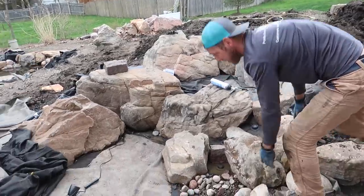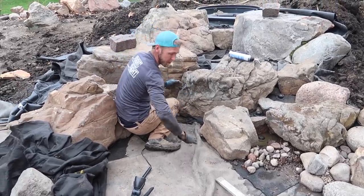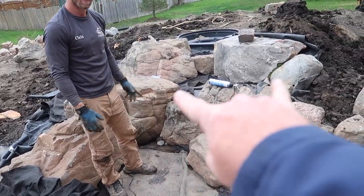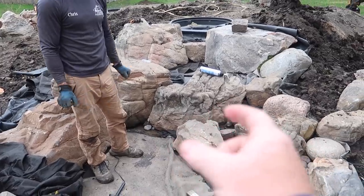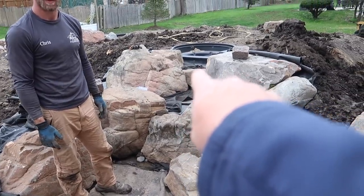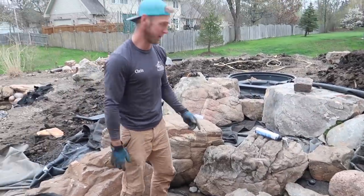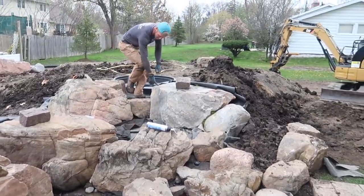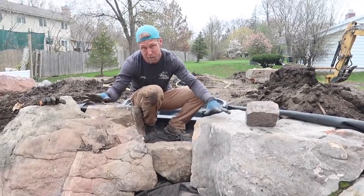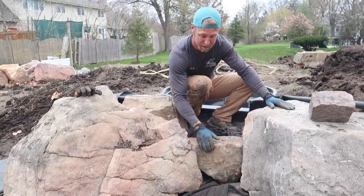The view from the house is going to be great. What I'm excited about is the change in elevations of the waterfalls. The 9PL is a bigger pump pushing a little bit more than 7,000 gallons per hour, which allows us to comfortably do a split like that. Without such a big pump, you'd get a trickle of water on each side. Up here water's going to be gushing through that — it's maybe 13 to 14 inches wide — so we'll get thick, thick water. Because of that thick water, we set these frame rocks high enough behind it to compensate and get that liner up extra high.